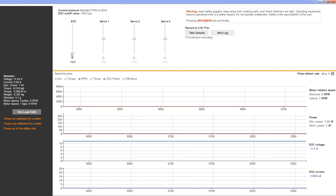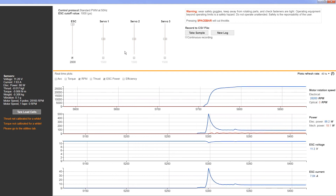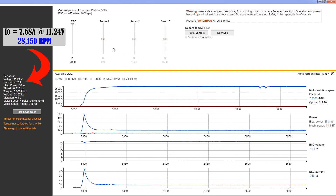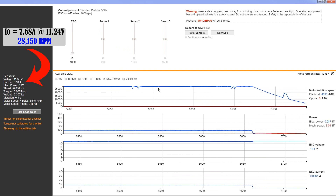The next thing is to get our IO value. I've hooked everything up to our lab test equipment, and we're going to run the motor at full speed using a three-cell lithium polymer battery. Most manufacturers measure IO at 10 volts, but we're doing it slightly higher using our 3S voltage. On screen you'll be able to see the voltage, the current, and even the RPM the motor is hitting.